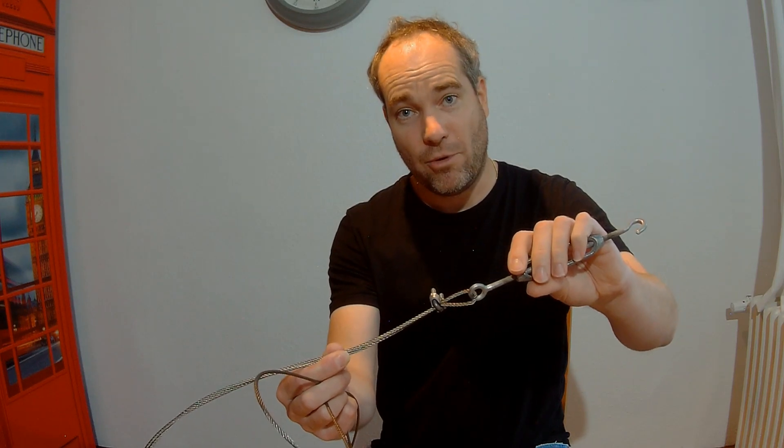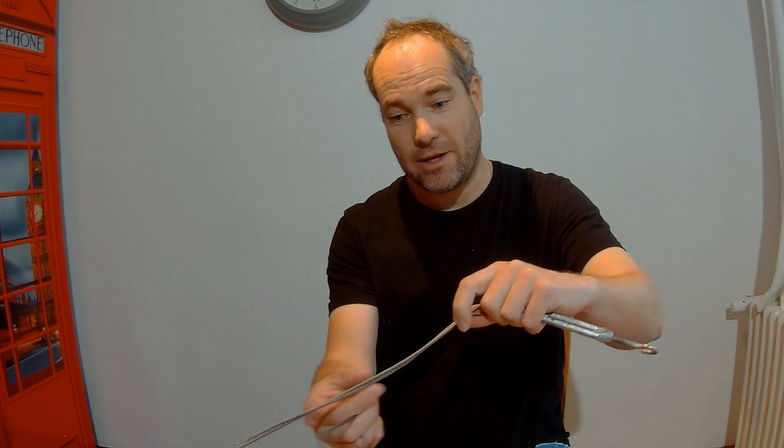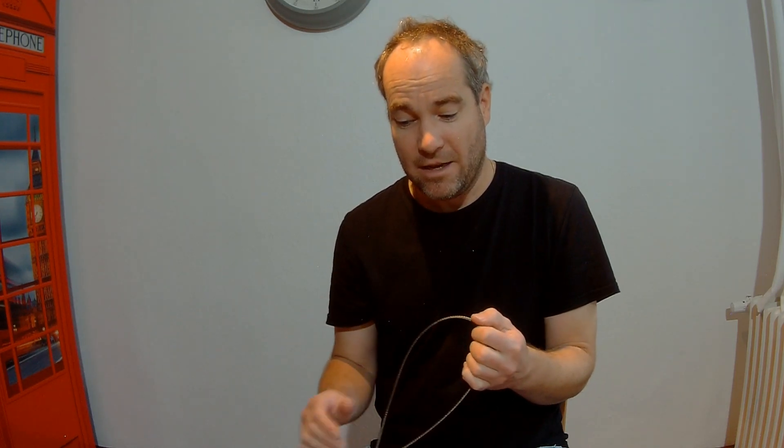Another thing delivered in insufficient quantity are the U-bolts for the guy wire — they only deliver one per side, and not even in stainless steel. Talking about the guy wire itself, in my personal opinion it's really too thin. This is the original guy wire, and they secure it with only one U-bolt. In my opinion this is quite unsafe — you need at a minimum two additional U-bolts, so three U-bolts on every side, to make it safe. Also the guy wire is too thin for very windy areas.